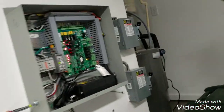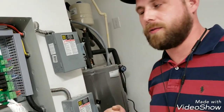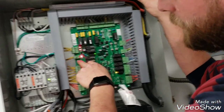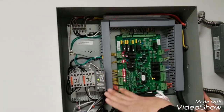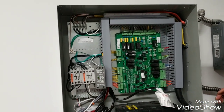For educators: if you have any issues, it's usually a door or a gate — one of those two left open. So try to get in the habit every time when you get out — close that gate back, close the door. All these lights right here have labels all the way down; they all have a meaning. If you do have an issue, the easiest way is to check your door, check your gate, come down here and do a reset. To reset: press and hold — when it quits beeping, let go. That turns it off.